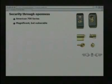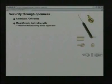Deep inside the core, this is the double ball mechanism. You can see this, the pillar that has the notch. The keyway and the key plug has a little semicircular notch that corresponds to a cut up here on the control cylinder. Notice, however, this keyway is cut all the way through the plug. Peterson made a great tool, and mine I've beat up so much it probably doesn't work, but we'll try it outside.